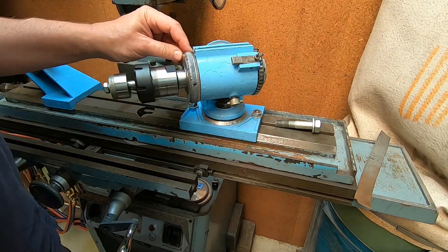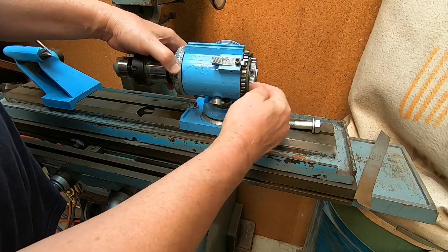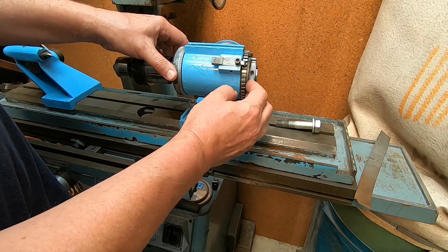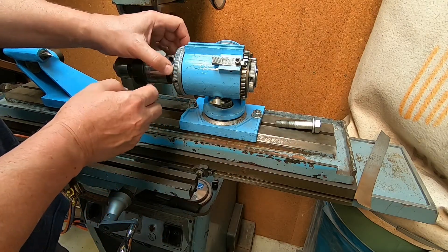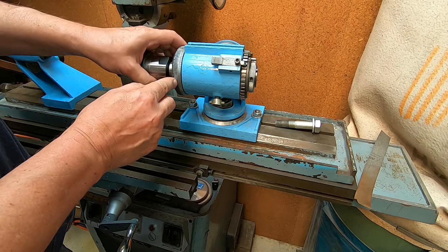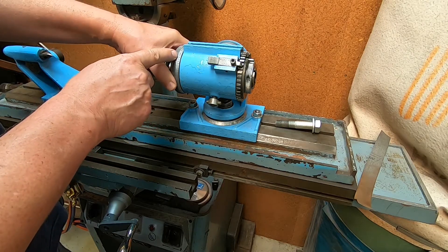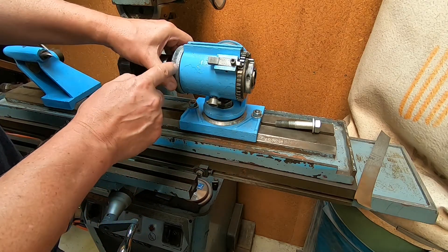This lock ring here is held on securely by a couple of grub screws, and it pulls the tension up. The back end has ball bearings — loose ball bearings — that sit in a taper in the housing. This ring here is threaded on the inside; you wind it up to set the preload and lock it in position. You can see it's also indexed around in degree marks, so you've got a couple of ways of indexing — directly off the notches or reading off the index marks.